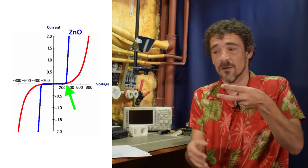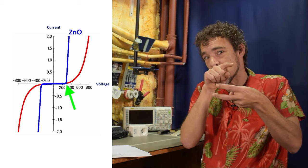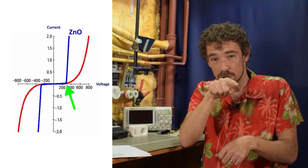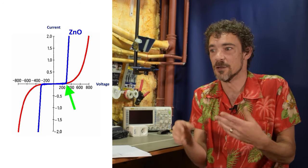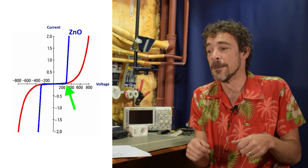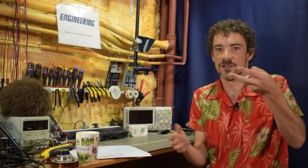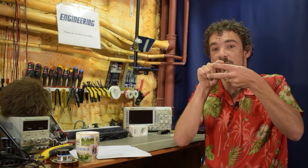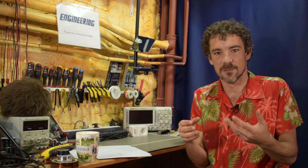If you're in North America that's 120 volts; most of the rest of the world is 230 volts. When you get a surge — a very short, high-voltage spike — which can cause very high currents to flow in timeframes of microseconds, the varistor will turn on and conduct the current. It shunts it and dumps it back onto the network, so that high-voltage, high-current spike doesn't actually go into your device and fry it — it's simply bypassed.